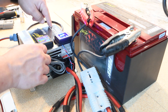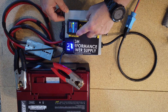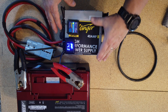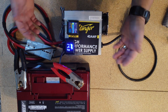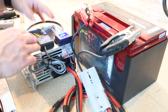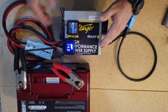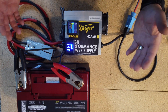I hope you enjoyed the video and you can see how versatile using an SPS40 power supply can be when you combine it with an SCM module and some SQD4 quick connects. You can utilize this at home, the shop, wherever you might need some charge current. As a point of note, the size of this power supply at 40 amps is much smaller than your normal battery charger, so it's nice and compact. You can install it in situations like a van or a show car if you have room, or you can leave it outboard and use the quick connect to interchange it for whatever purpose you need at the time. Thanks again and have a great day.